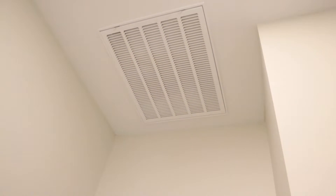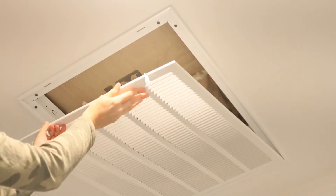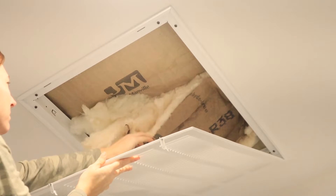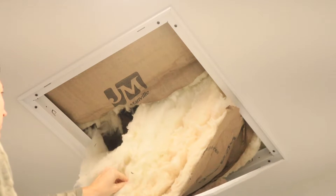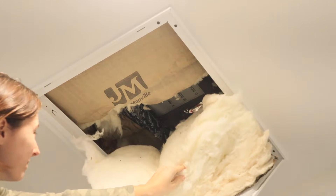While researching the mini split system, we realized that anywhere we have a pipe joint or a branch distribution box, we needed to create access panels in case anything ever breaks or needs service. We ended up putting two AC return vent grate-style panels right by our distribution boxes.